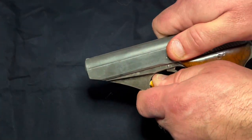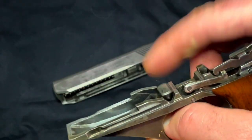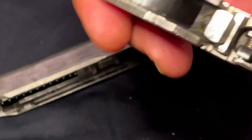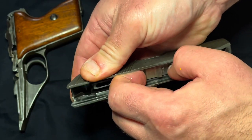While you're pressing down on the switch, you want to apply pressure forward and up on the slide at the same time for its release — similar to a Walther PPK. Once the slide is free, if you press that button again, there is a large plunger in the frame that moves. The spring inside that plunger is just strong enough to hold the slide into place. Inside the forward area of the slide, there are two cutouts on each side which correspond with two notches protruding from the frame.